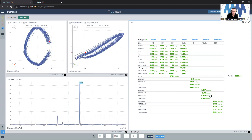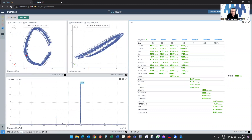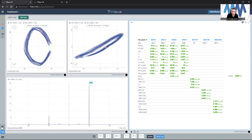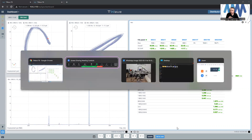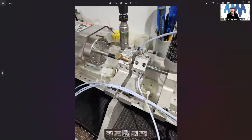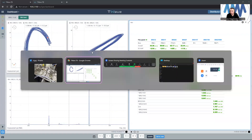We'll raise the speed up to about 5900 RPM. Here's our orbit. Let's see what will happen — now we are at 5918 RPM. This is the running speed. This is the orbit shape for bearing number one and bearing number two, and you can see how many revolutions are in the orbit. Now I will use this screw — I will screw it in, tighten it, and start to make the tip of this screw touch the shaft, and see how this will affect the orbit shape.